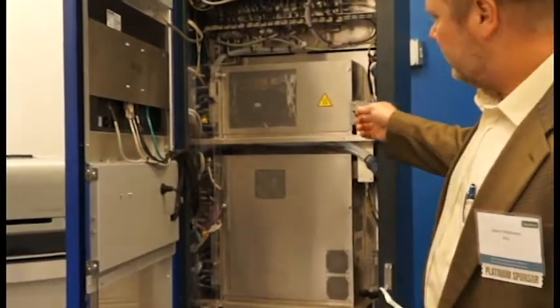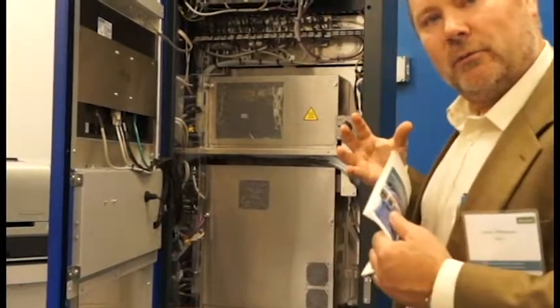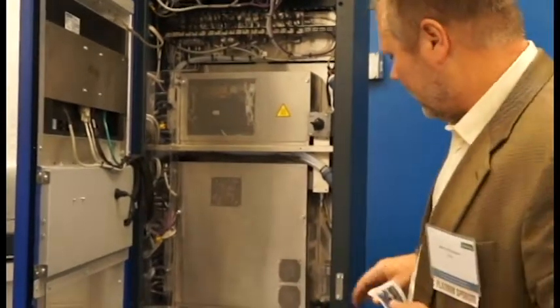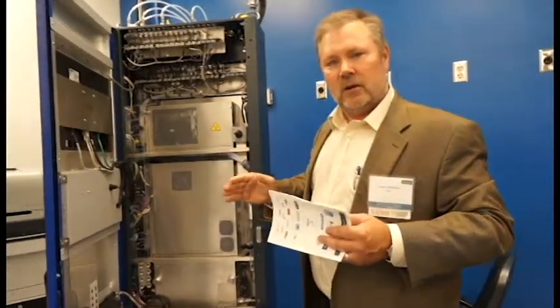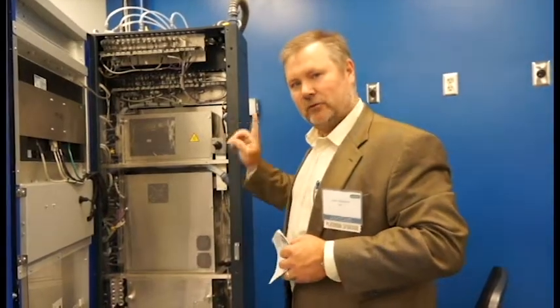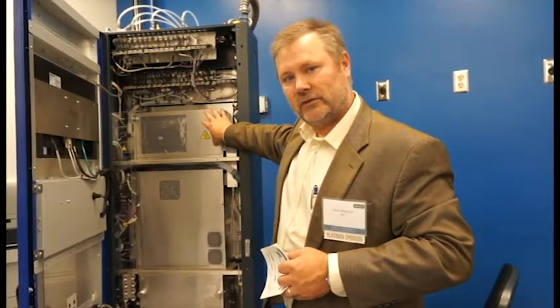All of this system is designed so we can pull a pin, take out a connection here, here, and we can quickly remove the piece of hardware and put a replacement in. So it's a plug-and-play system. Did I mention that it's low energy? Typical benches take somewhere between 20 or 30 to 50 amps of 110 volt power. And this system is running on 20 amps, one circuit. It's universal voltage. Everything inside is 24 volts, so it's safe to operate and work on while it's powered up,